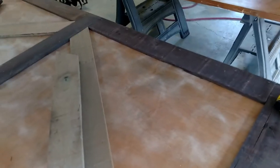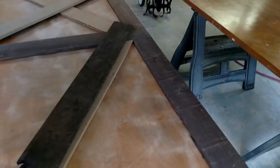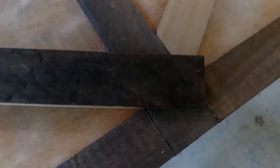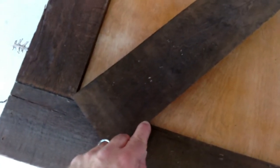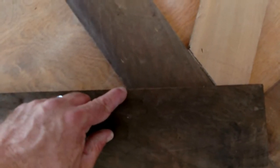What we do to make it easier: I simply lay this corner to that corner on the board, come up to the other side and make the same corner-to-corner mark. I put a mark with a marker at each corner and draw a straight line across. I do the same thing on the other end — marker in the corner on each side — and draw a straight line across.